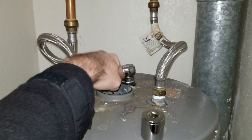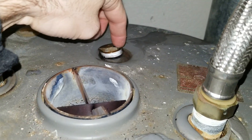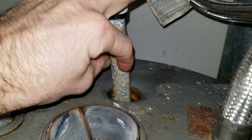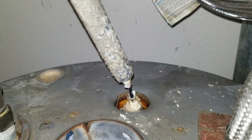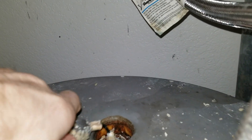Let's get onto the next step of removing the anode rod. That was relatively easy since I do this once a year. You're also going to want to open up a hot water line at your sink or whatnot — that'll help with some of the pressure, because once you start cracking this, water starts going out. If you have calcium carbonate like I do, this anode rod is supposed to be sacrificial and get eaten away, but I've had this same rod for a long time because the calcium carbonate just sticks to it and the rod doesn't actually deteriorate. I have a collapsible one — if you have limited space, you don't want a four-foot rod you can't get out. Get a collapsible one. Look at all that calcium carbonate — that's all sitting on the bottom of your tank and you've got to get that taken care of.